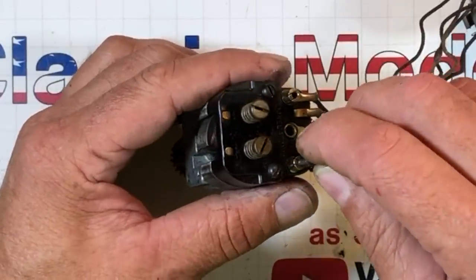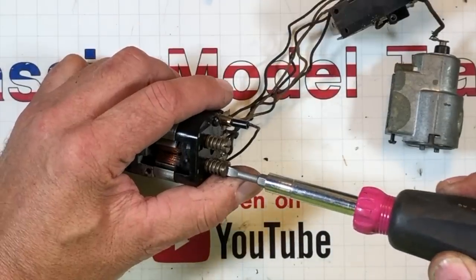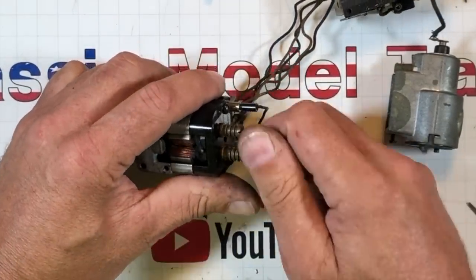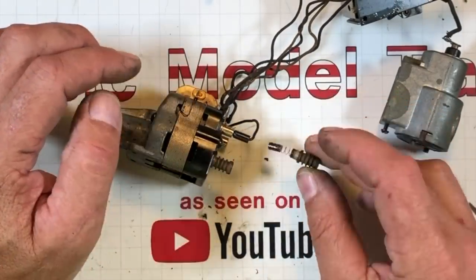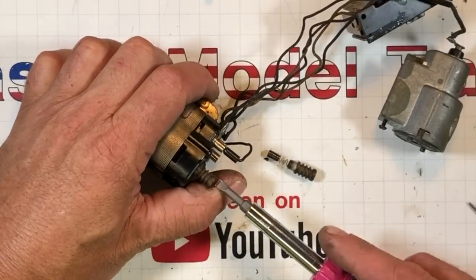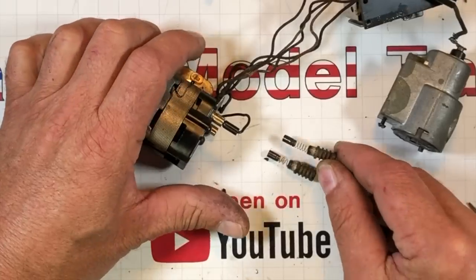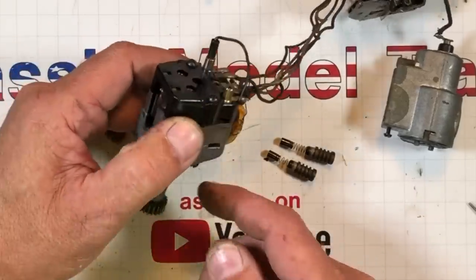None of the 2020s that were ever made came with magnetraction on them. Turns out they don't need them — they're so long they do an excellent job pulling long loads without it. Curious about this — it looks like some sort of field mod, maybe a lockout. Are there brushes underneath these? Yep, there they are, and they are oil-filled also. I need another tray, I filled this one up already. There's so much stuff. Another brush holder under here with some oily brushes. Armature, commutator's got scuzz on it.